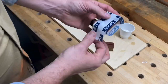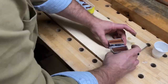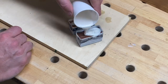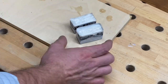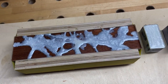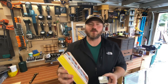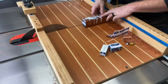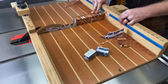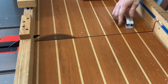With the larger piece set there to dry, I've taken a single kerf cut on two smaller pieces of padauk. We're going to tape these up making sure there are no leaks and pour that same white epoxy right inside — these are going to be made into a writing pen. With the pieces finally cured and ready to go, we're going to trim them up on the table saw, put them on the lathe, and turn them into something. I'm cutting at the table saw, trimming rough edges, putting them 90 degrees to the blade to make sure both ends are square.